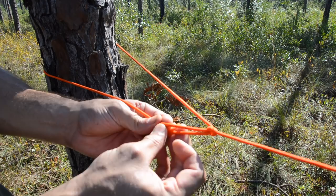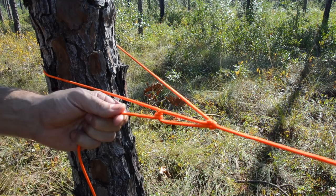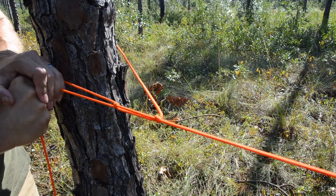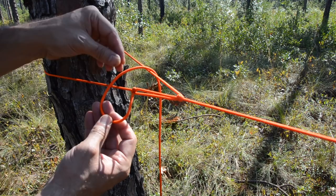I'm going to come through a second time to form a round turn — what we're doing here is establishing what's called a rolling hitch. I'm going to pull tension on that, and as I'm pulling tension that rolling hitch is going to roll over itself and capture all of that tension so that I don't have to sit here and hold it. Now I'm going to secure that with a half hitch on a bight — simply throw it all over to create a loop.